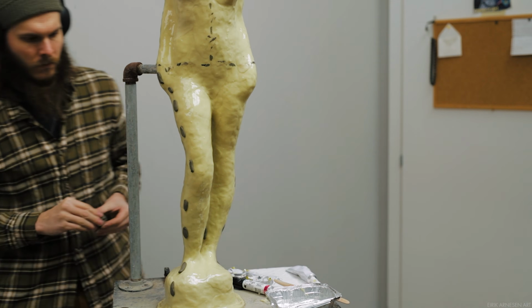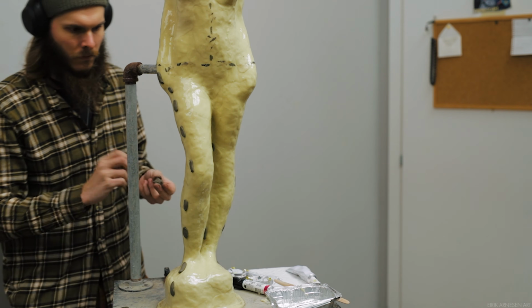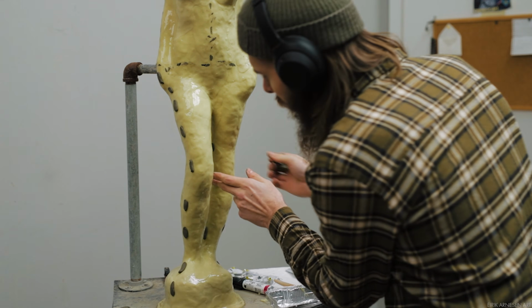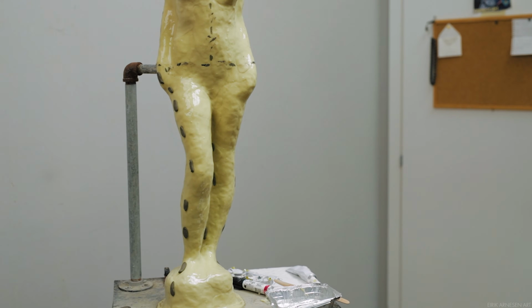So my solution to this problem is simple. Rotate what I consider as the front of the leg towards the 3/4 view until the left leg no longer is covered by the right. It's a very simple solution and one that I can use simply because I have separated the upper and lower half of the mold.